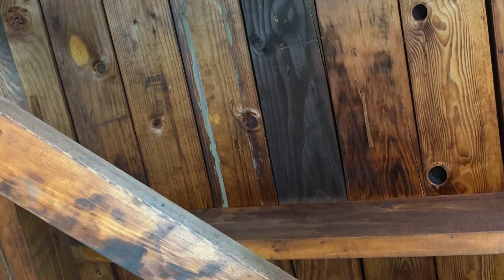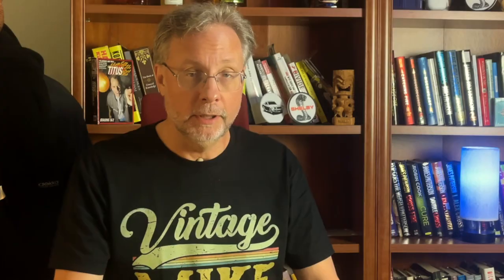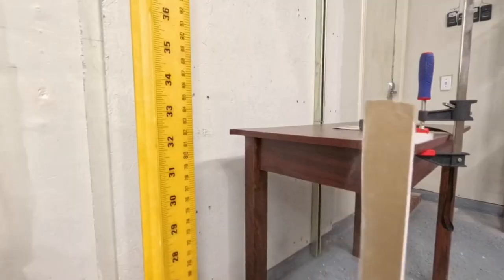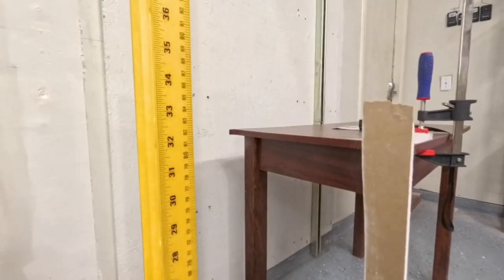How old are the boards? Have they ever gotten wet or moldy? Importantly, you don't want so much weight up there that your ceiling bows four inches — sheetrock can only bend so far before it cracks, and that's not even talking about nail pops. Time is also a factor: yes, I could put my car up there, bend the joists, and crack my ceiling, but after a few days it could fall through. However, the pertinent issue is my comic books could crack my ceiling. So we're counting back to square one.